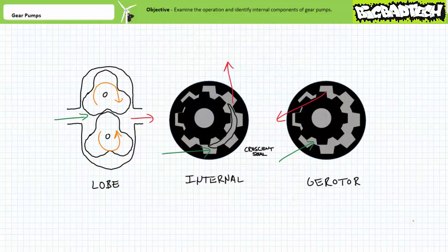Note, external gear pumps have a reputation for being extremely tolerant of less than clean fluid because of their relatively simple construction. After all, there's really only 2 moving parts, the drive and driven gear. For this reason, external gear pumps are reliable, robust, and inexpensive. However, not exactly the most mechanically efficient pump, nor suited for extremely high pressure applications.